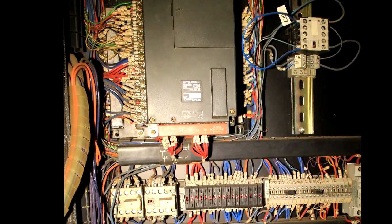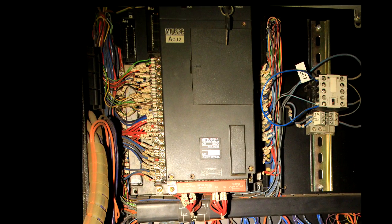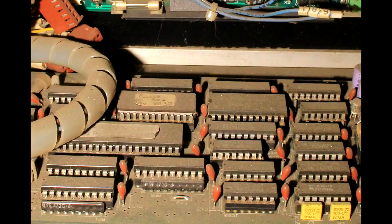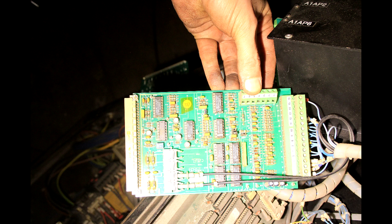Above that is the lower-power control section. At the top there's a PLC — programmable logic controller — that controls things like the sequencing of the vacuum and gas filling cycle and various other aspects of the system. There are a few boards with various electronics; I'm not completely sure what one of them was, though I noticed what looks like a processor on it, which may provide an external interface to the CNC motion control.